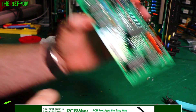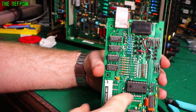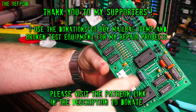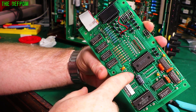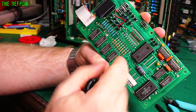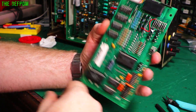I took away the minus 175 volt rail, which is over here on the other half of the board, on the other side rail, same position. Lifting that link - it was link one, link two I think it was. So then I could use a low voltage capacitor here. This is basically across the zero volt rail now, because it used to go to 5 volt and minus 175 volt. Because that's now the zero volt rail instead of minus 175, I've changed it to a 16 volt 330 microfarad cap instead of a 10 microfarad high voltage cap.